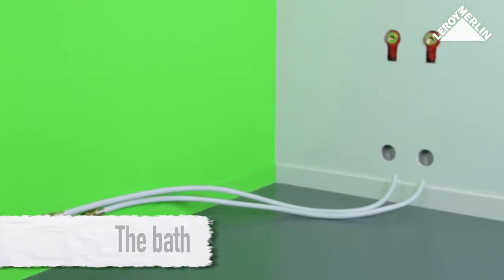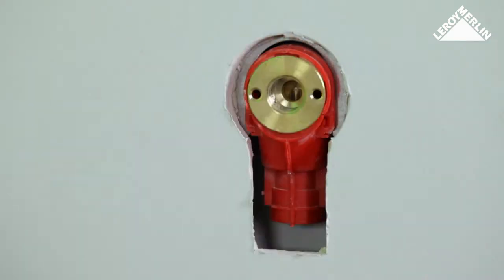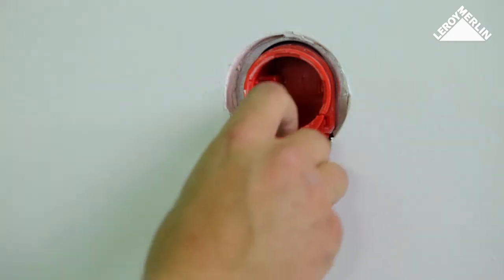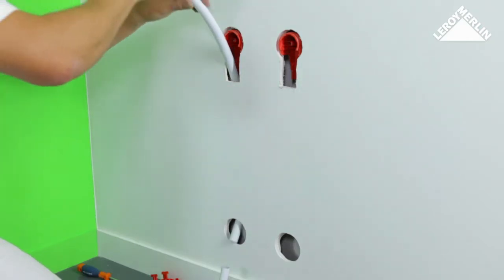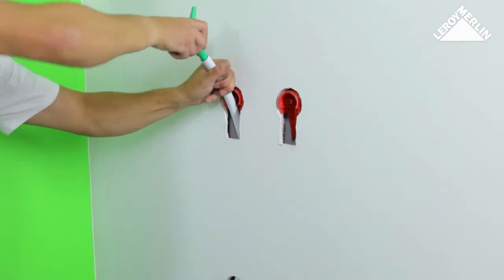Near the bath taps, create 2 openings to allow the 20mm diameter pipes to pass behind the insulation. You will need a special multi-layer partition outlet kit. Set 2 90-degree mounting bases into the insulation material to allow the exit joints to extrude through the wall.